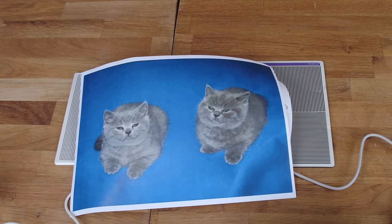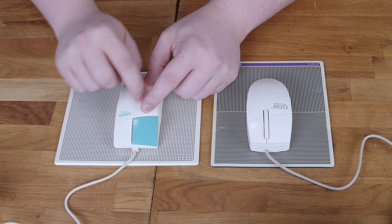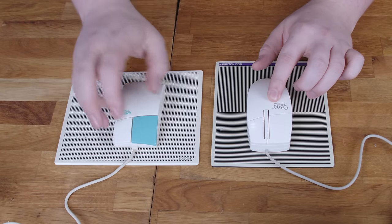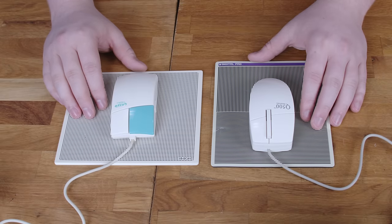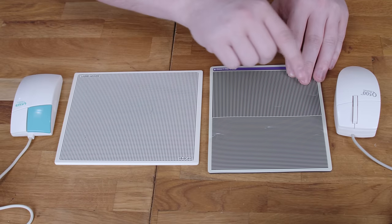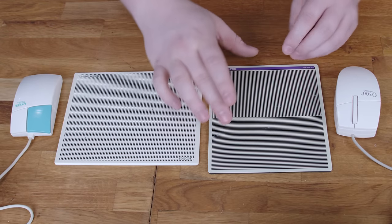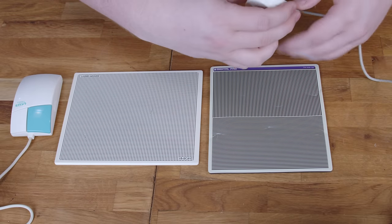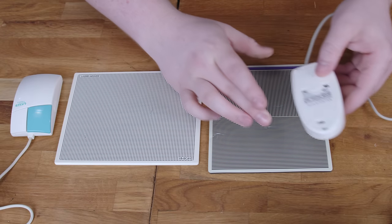So, two of them. They have a couple similarities visually speaking — they've got the slab sides and high gloss surface finish, but otherwise they're pretty different. The feature button on the Q500 is in the middle, while the LMOX has it on the side. And of course the overall shape and color schemes differ completely. To recap, the Q500 has two regions of one-dimensional patterns, so each area only contains the info for one axis of motion. This pad has to be this exact size — no larger — because the regions have to be exactly the same height as the mouse itself, otherwise the sensor could fall off the bottom or the top of its respective region.